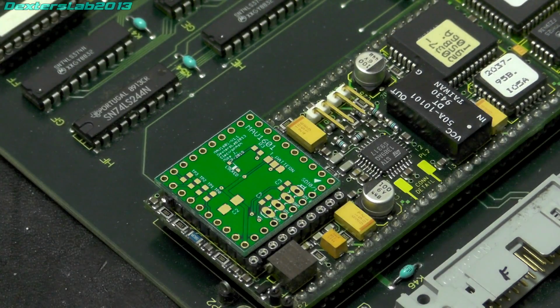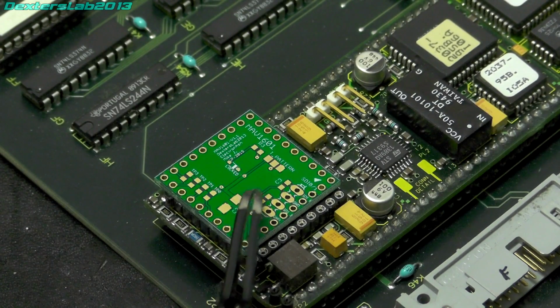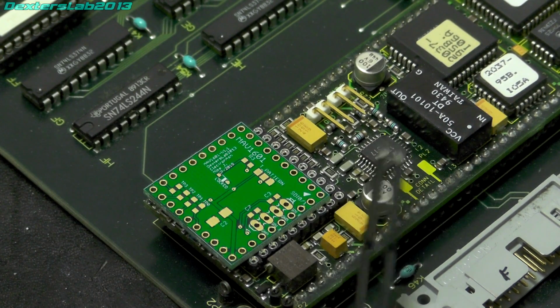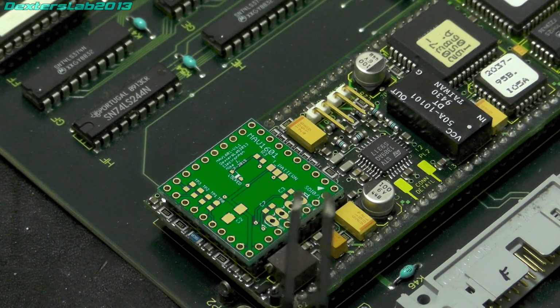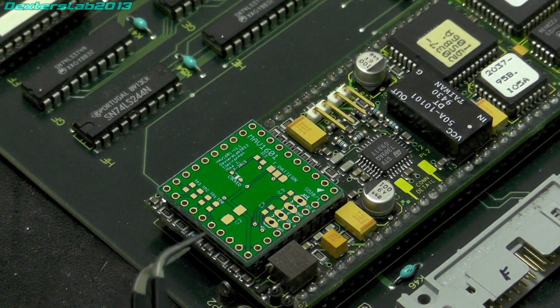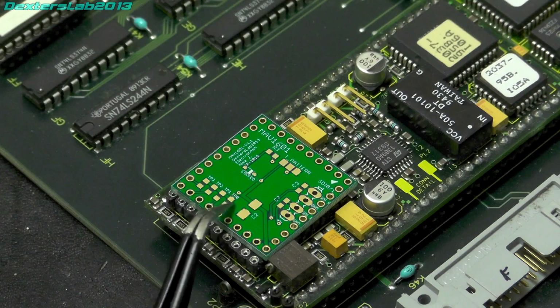Now the CLC 020 has a built-in line driver, so I don't need any of this. I can literally just bypass it, and that's basically what I've done. So instead of sending the SDI down through the existing connections to the line driver, I don't need to do that. So I can just add 2 pin headers on here, and the cable that plugged on there will just plug on here instead. Now you can probably also see a couple of other pads that I've got on here, these ones just down here.